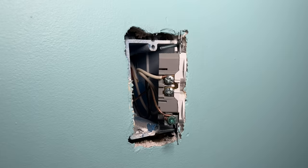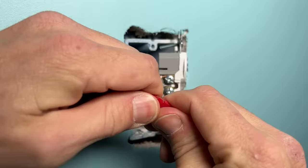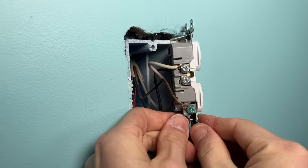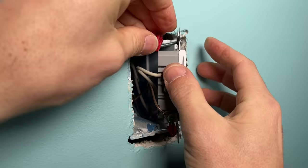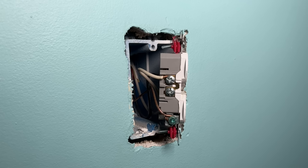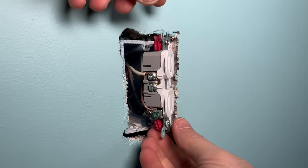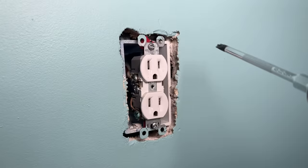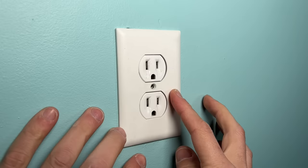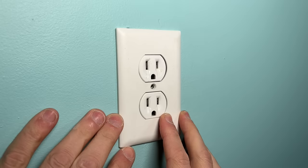All I do is fold it over — I want a quarter-inch spacer, so I rip one off, then rip off another. I like to keep the opening facing the bottom on both the top and bottom spacers. I insert the spacer with the opening facing down, which helps hold it in place so it doesn't fall off or get misaligned as I tighten the screws. Then I just line things up and tighten it back down. Now we have a secure outlet. I'll do a dry fit on the wall plate — overall it's looking much better, and once tightened down it'll be pretty much perfectly flush.